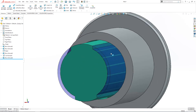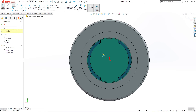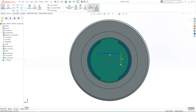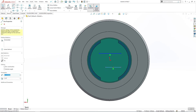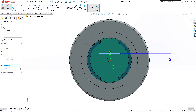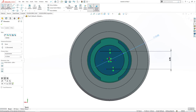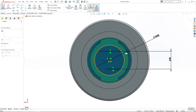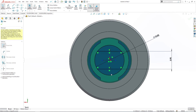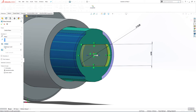It will be this kind of glass. Sketch on this surface and make two lines plus one center line going through the origin point. Make these three symmetric. One dimension here has to be 5.9 millimeters. Make one circle that will be 10 millimeters and drag these points to this circle. Use trim entities, trim this, then go to extrude boss base one millimeter — uncheck this box and click OK.